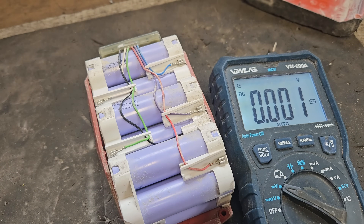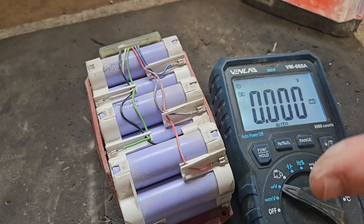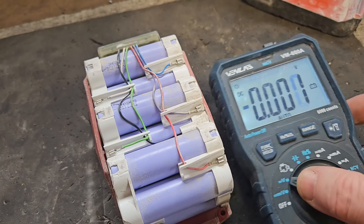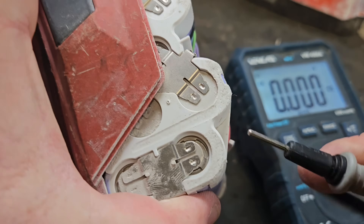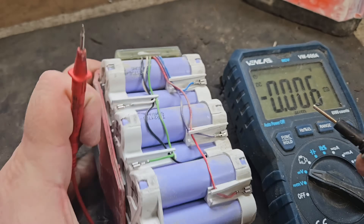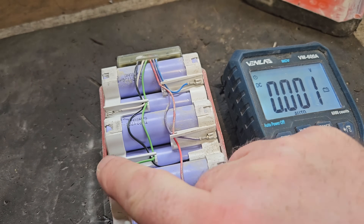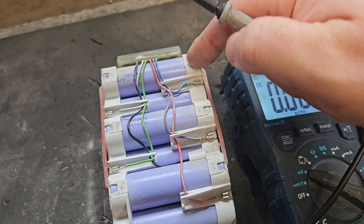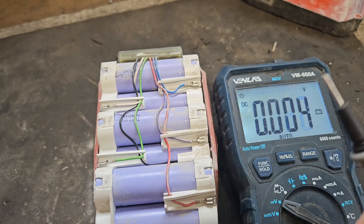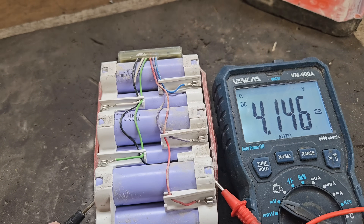To detect this problem and find where the fault is, here's what you do. Set your multimeter for DC voltage. The positive terminal has a raised shape and the negative is flat. They alternate positive, negative, positive, negative all the way along. You measure the voltage along all the banks of cells. That's 4.14 volts — that means that's a fully charged bank of cells. The reason it stopped charging is that one or more banks reached their maximum, and the charger can't charge anymore, which is actually a good thing so you don't overcharge the cells.